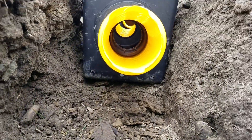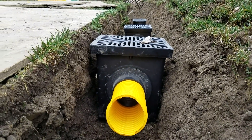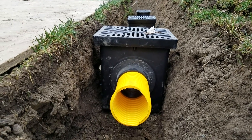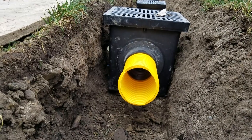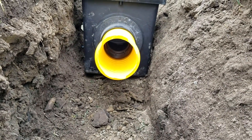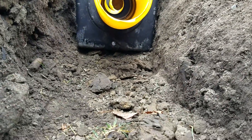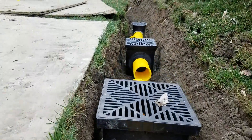And then they're choking it down to a four-inch pipe, which I don't like. I build a lot of really long run systems where you're taking on your water, your neighbor's water — you might be handling water from three or four lots — and they're choking it down to a four-inch pipe. The stone moves as much water as the pipe. This is a failed experiment. The jury is in.